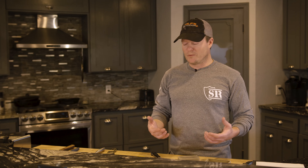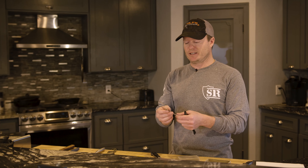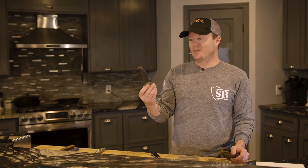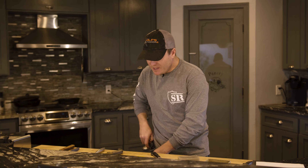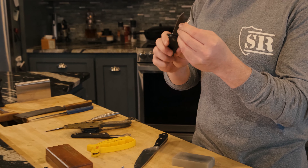I like my knives really sharp, so I usually go for a lower angle like 20 degrees. Now, 15 to 17 degrees is like razor-blade territory — at that angle they'll shave hair, they're super sharp. Some people like that razor-blade feel for skinning blades, but the downside is if you hit bone it'll dull the blade so quickly. For something like this heavy Surefire knife on my camping pack that I won't sharpen all the time, I'd want probably a 30-degree angle.